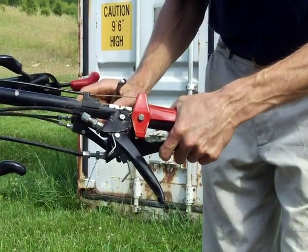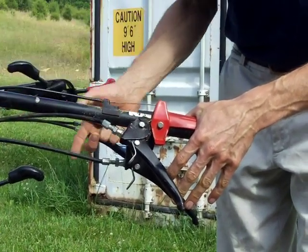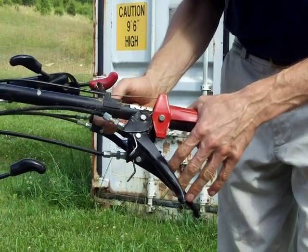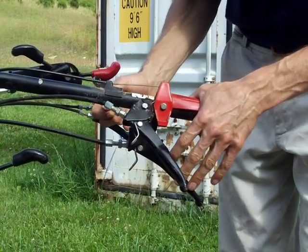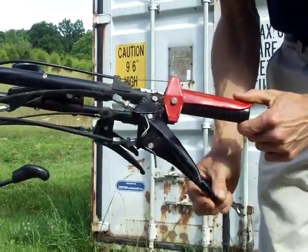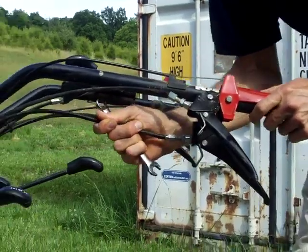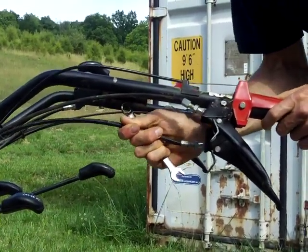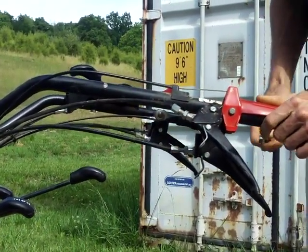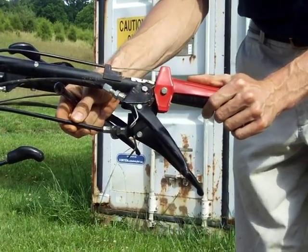The number two criteria is that when you release the clutch away from the handle so that the machine can be in motion, there should be some slack in the clutch cable. Slack can be measured in a couple ways — you can measure it right here. I can move the sheath in and out of the adjustment bolt. If there's slack in the cable, then it's safe to run the machine with full load on it.